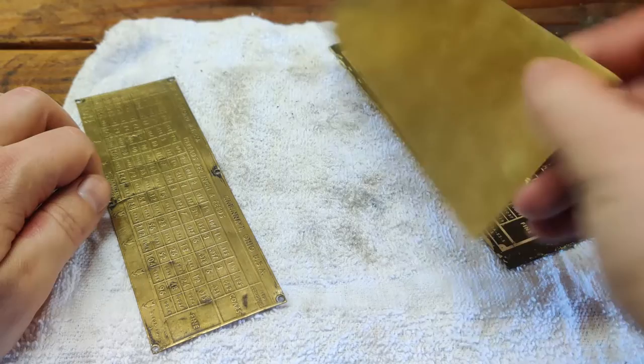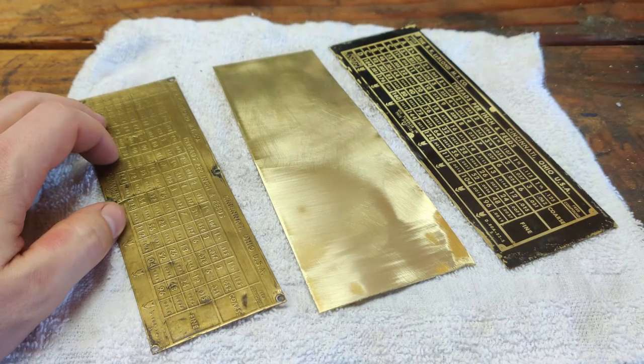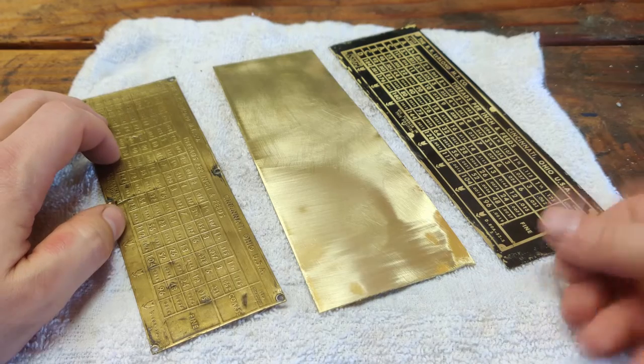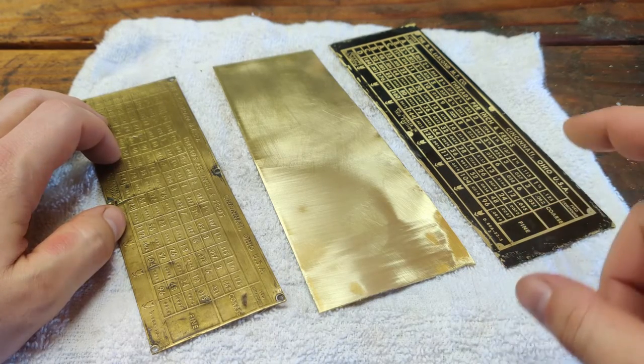I did a test before, and while you could say this is good enough, there's definitely areas up here where you can see that it didn't really etch evenly. And over here it's really shallow, and it was kind of hard to get even this kind of look on here. This is also just some cheap spray paint, whereas I want to actually put a good enamel paint on there. I've already cut out another appropriately sized piece of brass sheet, and now I'm going to get on to applying our transfer layer to this and starting the etching.